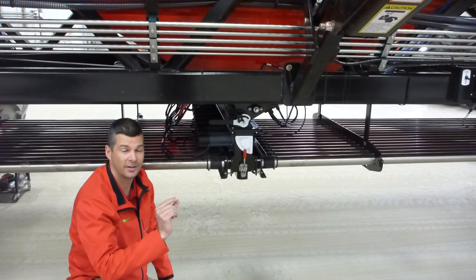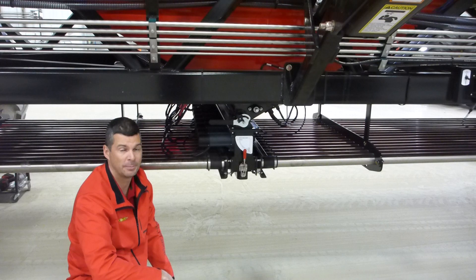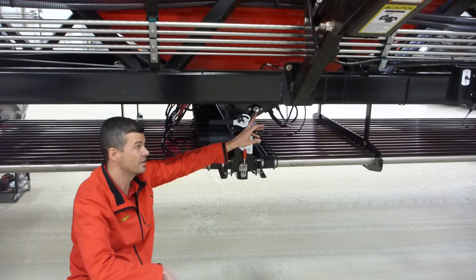there is actually a very small key stock on the other side connected to the agitator motor, and you'll break that key stock. If you break the key stock, you have to replace the motor — it is not a replaceable part. So just make sure you're checking this on all tanks first in the year.